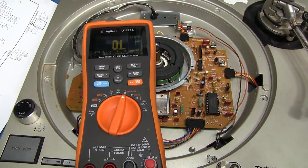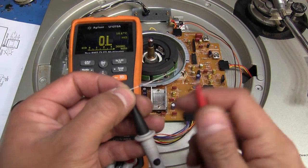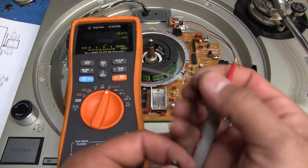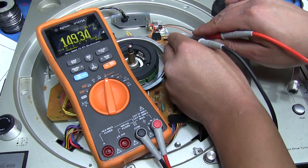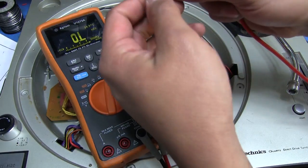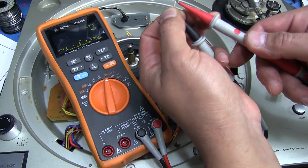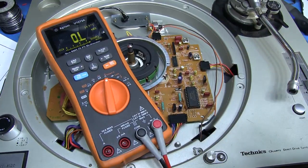Let me see if I have a 150-ohm resistor laying around. Turns out I did have some. Sure enough, 150 ohms - and it's also an eighth watt, just like the one that's in there, so it'll be a direct replacement. There it is, reading 150 ohms at that point. Here's the old resistor - it's reading almost 5k but has the exact same markings: brown, green, brown. I'm guessing this probably took a hit when the whole thing got shorted out.